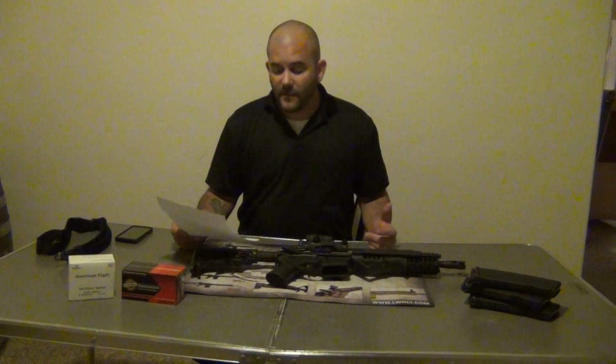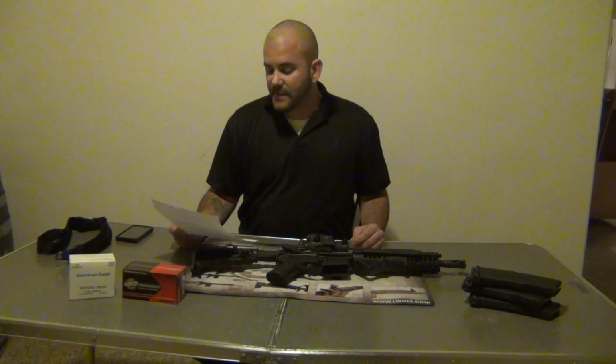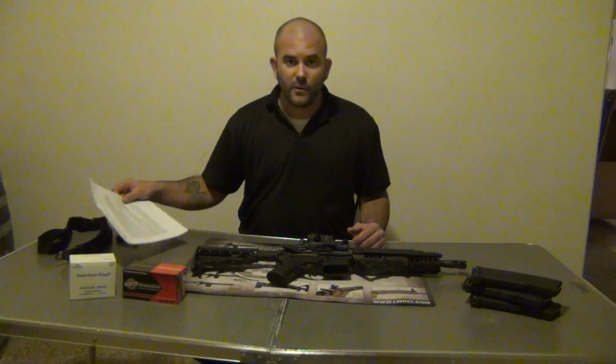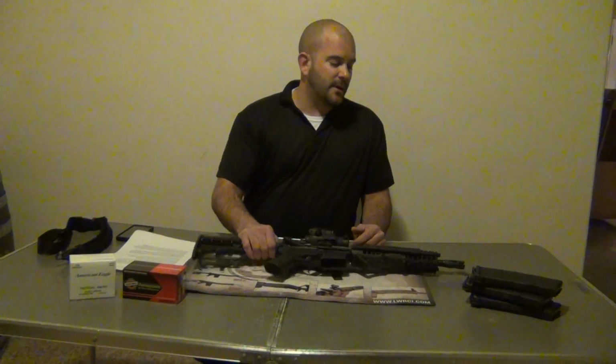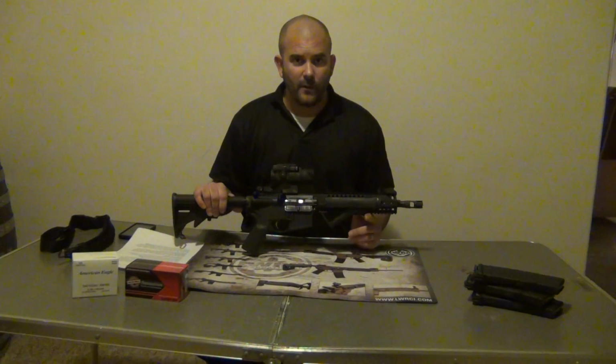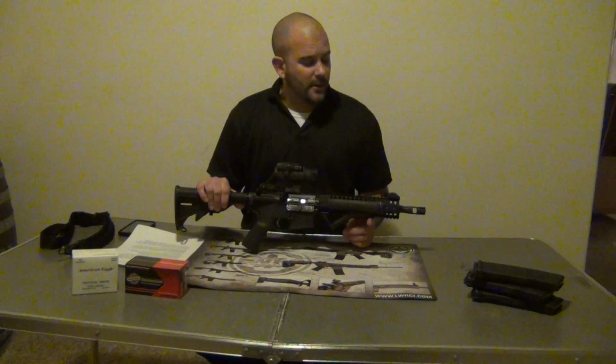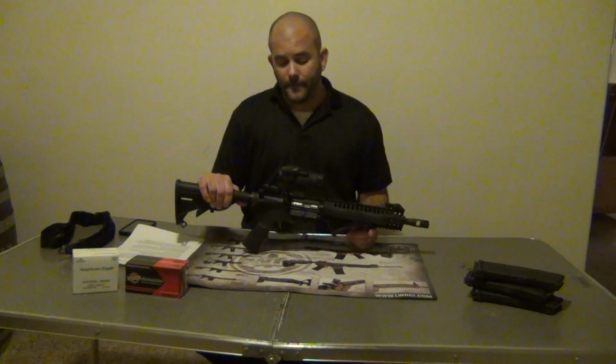What that really means to us is that it imparts excellent wear resistance, increased yield and fatigue strength, lubricity, and corrosion resistance. So what you're looking at here is a guaranteed 2 to 3 times life out of the barrel. So for a couple extra bucks, I know these things aren't necessarily cheap, you're going to get a gun that's going to last twice as long.